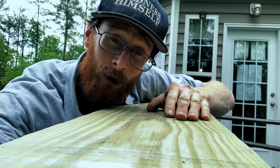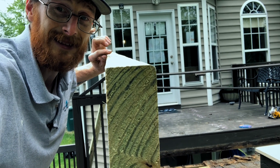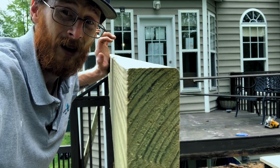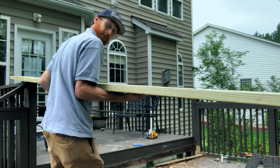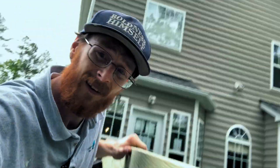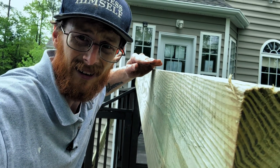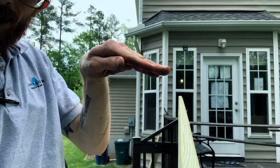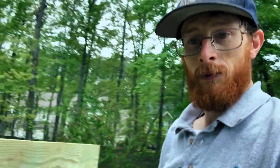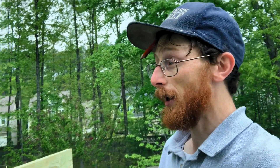When you go to put your new joist in, you need to find the crown. That means you're going to have to look down the edge of the board, just like that. You see how this side kind of dips in — it might be hard to tell on a video camera, but we'll flip it on the other side. This side has a little bit more of a hump to it — like this, not like this. So take your pencil, just like that. That's how the pros do it. They put their pencil in their hat just like this, until it constantly falls out and you end up putting it in your back pocket.